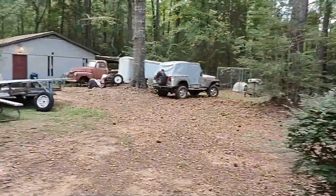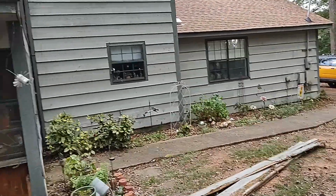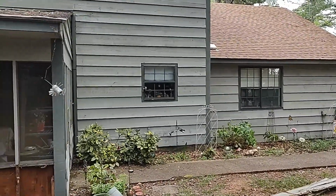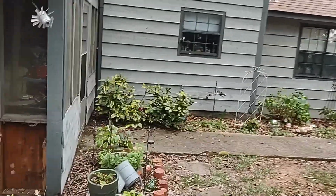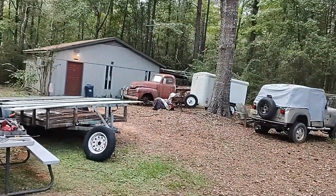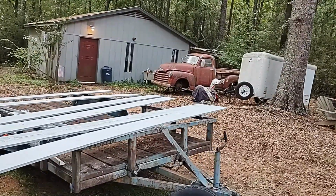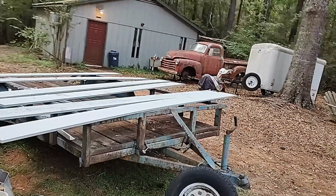So I watched his video and he made a terrible mistake. Every place that he went up there, that whole building was smooth side. And every board that he replaced it with, he used the rough side cut. Looked horrible. And he was also one of them that did not paint both sides of the board for the bottom. Now, I went ahead and painted all the boards on both sides just as preventive maintenance. So whoever buys my house next, they'll probably appreciate that. But I'm also going to put all the rough cut out, and I know that they'll appreciate that. All right then.